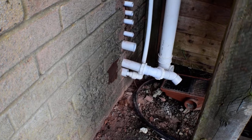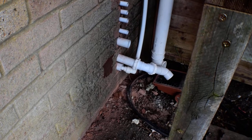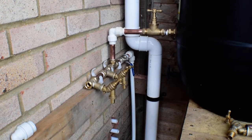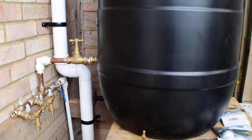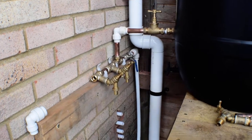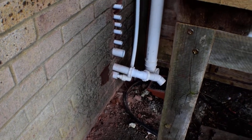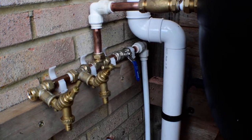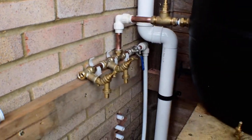That is going to come from the water butt. I've just fed it through there — it's all coiled up in the garage at the moment. When I get a moment I'll run it out and it will just stick its head out like this and then come up and connect to any water barrels I'm going to have out the front, which will just increase the capacity. These are 210 litre — I thought they were 300 but they're 210. If I get two or three out the front, I could have 800 litres of rainwater ready to go. It just comes out, goes into an elbow, tucks up behind that pipe, comes up and then goes on to the end of the rig where that blue lever is — that's a shut-off valve. So if I ever need to do any adjustments, I can separate the actual stored water so I don't have to lose any.